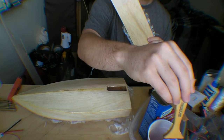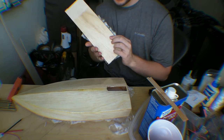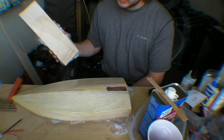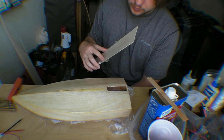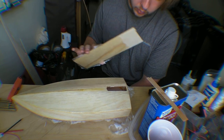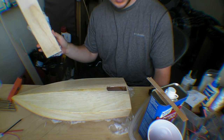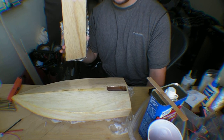This one I used this paintbrush right here — I'm soaking it in denatured alcohol to try to get the epoxy off so I didn't have to buy another one for the next coat. I painted that on thick and watered it down as well so it would permeate through the wood. After this dries I'm going to sand it down, then do the top and do the same thing for that, sand it down. Then after that I'm going to do one final coat of finishing epoxy resin, sand that, prime it and paint it. I'll probably do the final sanding, priming, and painting after I do the testing.